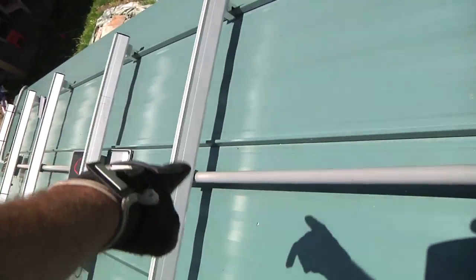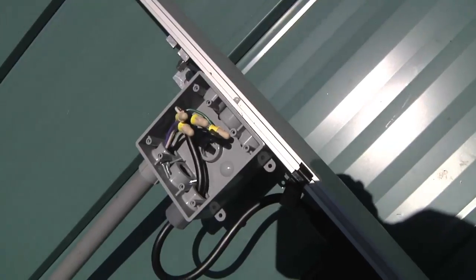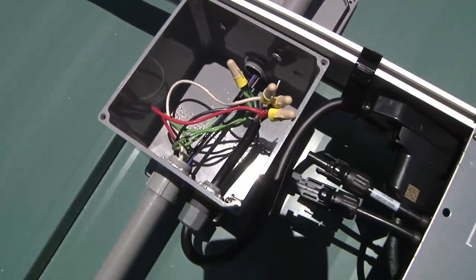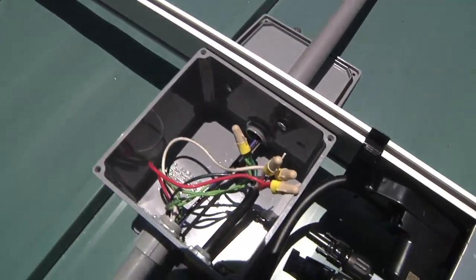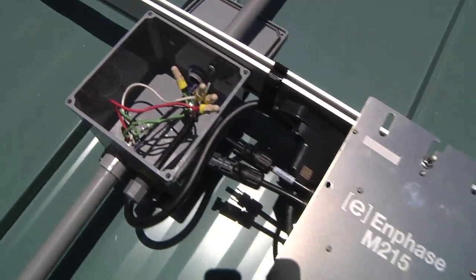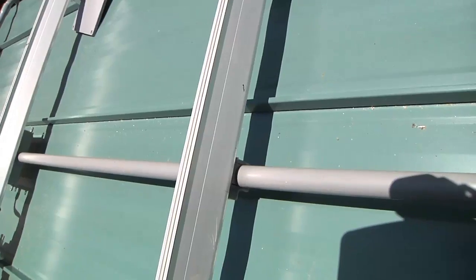This comes down with three-quarter-inch PVC to the middle box, and that is supported every 36 inches. But this is one circuit, and the wiring is going to just pass through that box and on down. Now here in the middle box, the wiring that goes to the top box simply passes through as its own circuit. And here we have another circuit started with the connections from the middle row of microinverters. The conduit just passes down the roof, supported underneath the next section of racking.